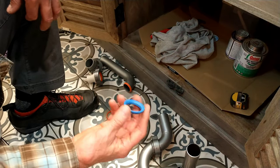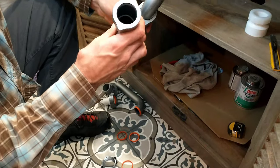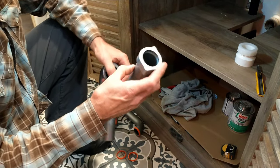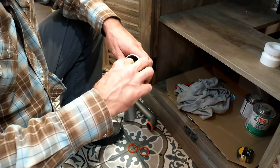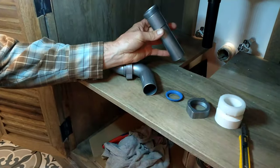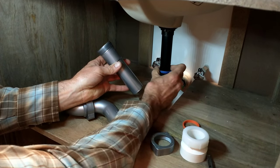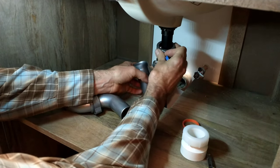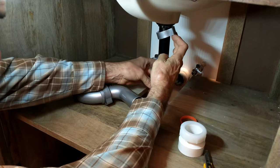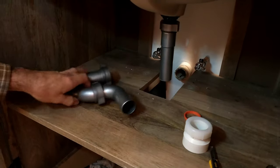The gaskets are color-coded, so you have to figure out what gaskets go to what pipe. Each one of these parts is going to require a gasket that goes in here. My drain tube on the sink is much smaller, and as you can see, this gasket here is too big. You just want to find the right one that fits over it tight — that's the blue one right there. You're going to slide the fitting on there first, then the gasket with the tapered side facing down, because it fits into the pipe nice and tight. We're not going to tighten this down yet, just snug it up and slide it all the way up.